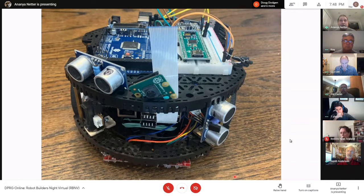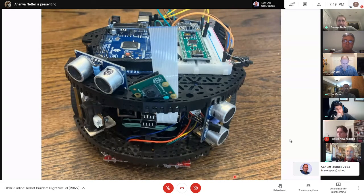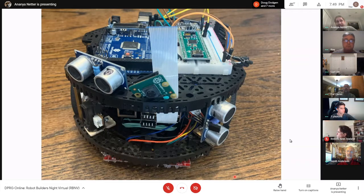One lesson learned here is that when talking to peripherals, and when having a choice, use a peripheral that has a dedicated reset line, because that OLED doesn't have a reset input. I can't reset the OLED. I can reset the BNO85. Depending on who you consider the master, if my Pi is the master, I can reset my green pill processor, but the OLED has only power, ground, and I squared C. I cannot reset it. So unfortunately, it's working fairly reliably, but every once in a while it gets into that state.